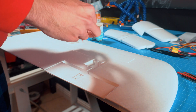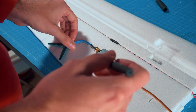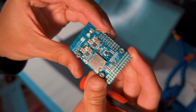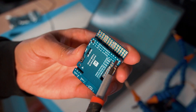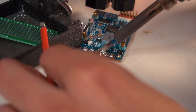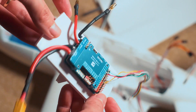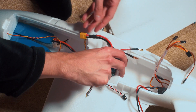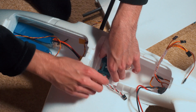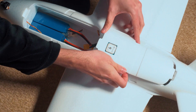I'm placing the video transmitter under a wing and I'm using the 1.3 GHz system to have a lot more range. Now it's time to solder all the cables and pins to the flight controller. If you want to know more details about this project, visit joyplanes.com — the link is in the description below. There's a blog post about this project with all the details, including a diagram of how I wired the flight controller. Here I'm testing the foam board base for the flight controller to fit it inside the fuselage, then I'll glue it.